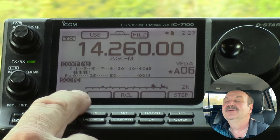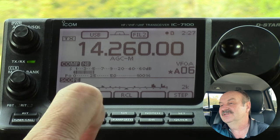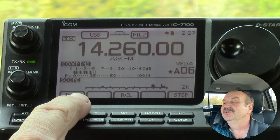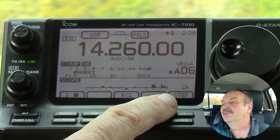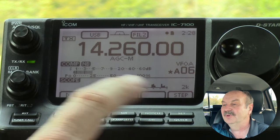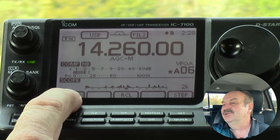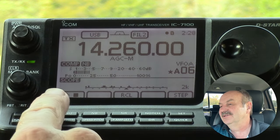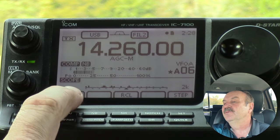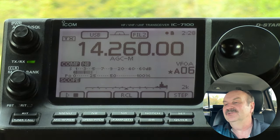So I've got a total of 60 dots - basically 30 below and 30 above. If it's 2kHz per step, this is going to sweep 60kHz below to 60kHz above. That's enough to cover the entire 20 meter sideband portion, because I'm on 260, so that's going to go from 14200 - there's a little bit further down in the extra class section - and it goes up to 14320, and a little further to 350, but covers most of the band. Every time I press this, you'll notice this changes because it's doing a sweep across, and at each frequency you're seeing a snapshot of whatever the signals are at the instant it checks them.